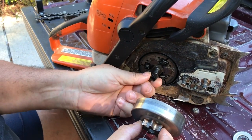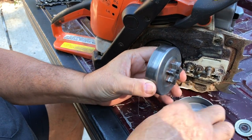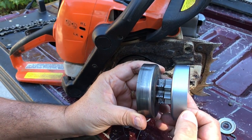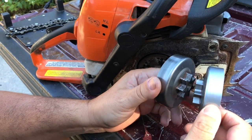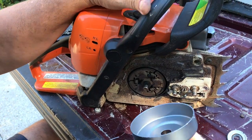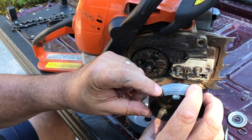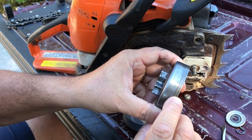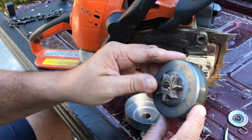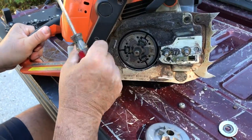I had this off yesterday and put a little oil on it, so I'm going to show you the difference in the sprockets — how worn they are. It's not terrible, I've seen them worse, but that explains why it doesn't quite go around the bar. There's a notch here — sometimes at these notches you'll get a split and as they go around they'll dig into the case on the outside, so it's always a good thing to double-check. But this one is not split.